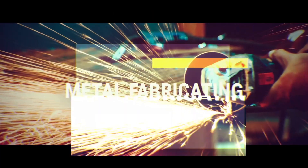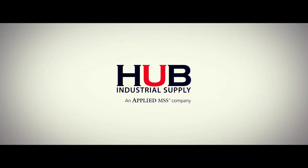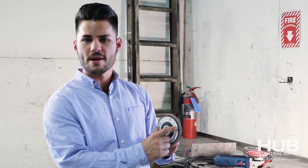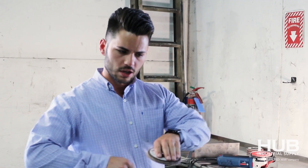Today we're going to be demonstrating our cornering flap discs. A cornering flap disc is very similar to a standard flap disc, only we've trimmed back the edge a little bit so the flaps stick out further. What that allows you to do is when you put the grinder and jam it into the corner, the flaps stick up on the other side of the material so you can get a lot more done with one pass.